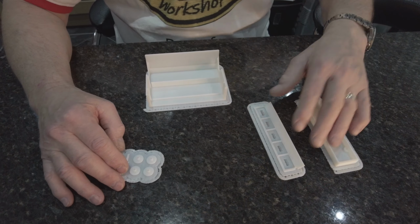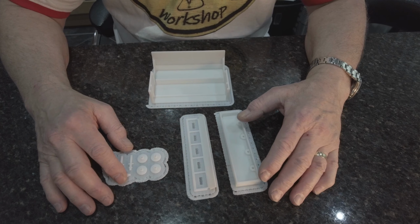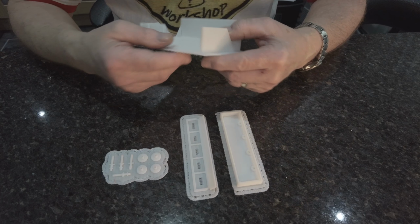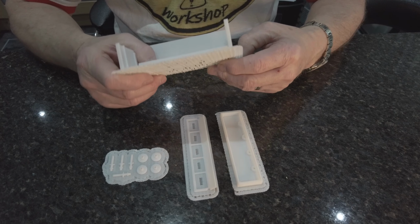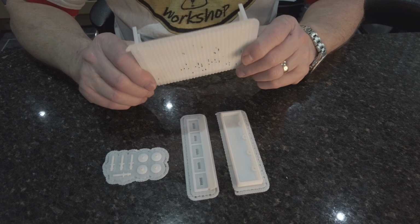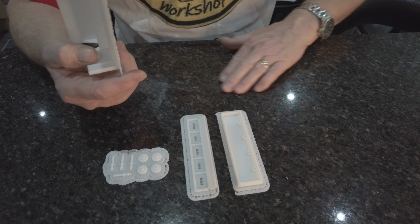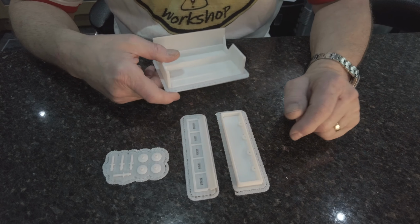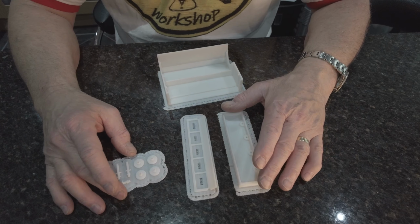Right, here we are. These are the 4 components. As I explained to you on Fusion 360 when I was doing that, this is the main base, and you see it's still got quite an extensive raft that the M200 builds, but structurally it's good. The only downfall with it is sometimes it's very hard to get off the printer bed. You can see all the little holes, that's where the plastic goes, the bed on the M200 is full of little holes, if you've never seen one.